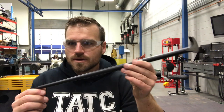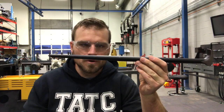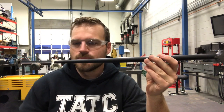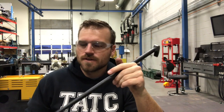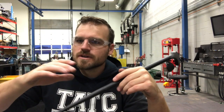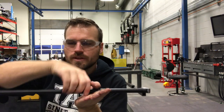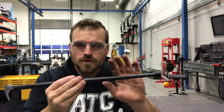Now these heel bars — these are pretty cool. You'll notice one side is tapered all the way up a good distance. The reason they do that is so you can use it to line up things, like you can line up two holes together. With two massive plates you can shove this through the center to get the holes to line up correctly when you set it down with a crane or something like that. Or if you have two plates laying on top of each other with a hole, you can pull them around with this bar.